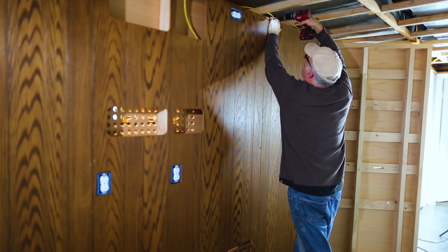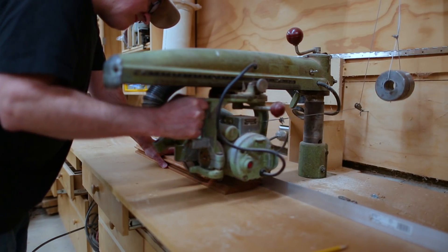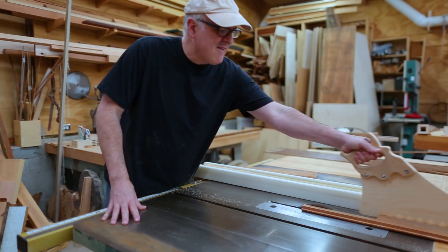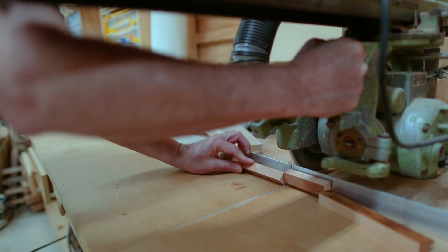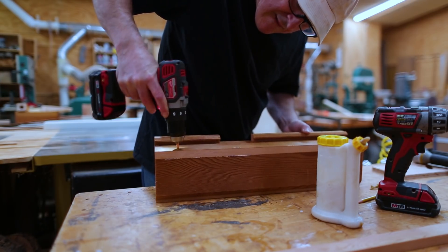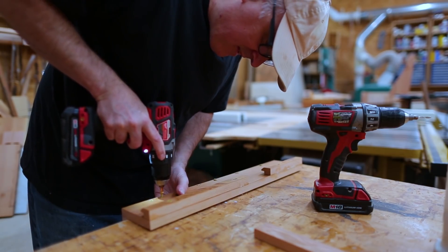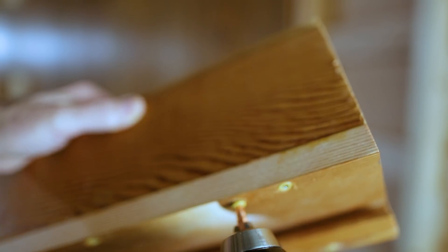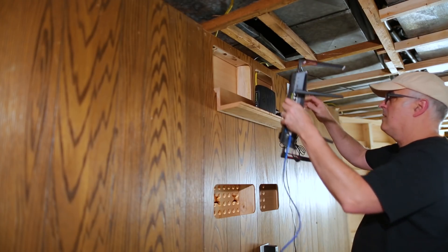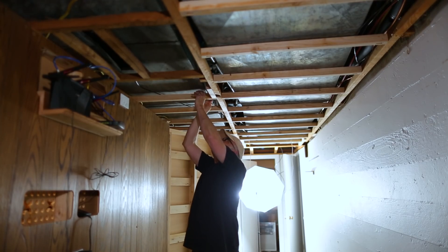With the CNC you can be perfectly precise in the wrong way. I wanted to make a temporary shelf for the router and modem, as I can turn the power off in the house without bothering anyone too much — but turning the internet off for even a few seconds, everyone starts to yell at me. So I needed to move the router and modem and quickly reconnect everything. I made a little shelf that works like a French cleat — it has a little lip that hangs over the edge of the wall panel and holds itself in place. I made the lip a little bit big and added adjustment screws so I can adjust how level the shelf is, then put the router and modem on it and wire them in place.